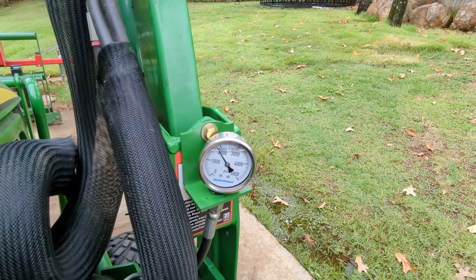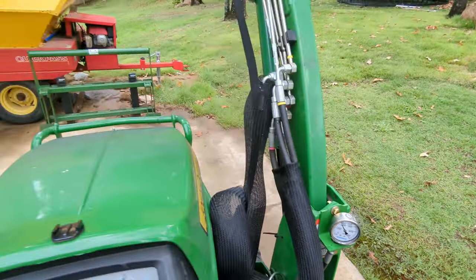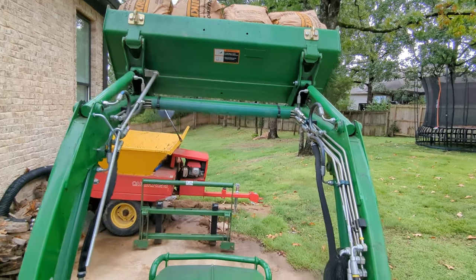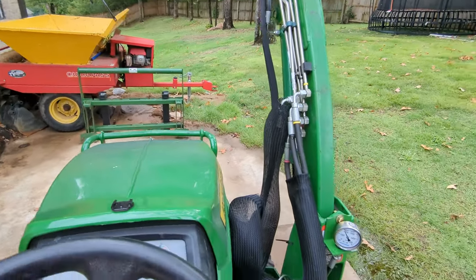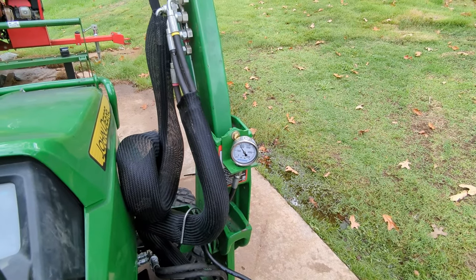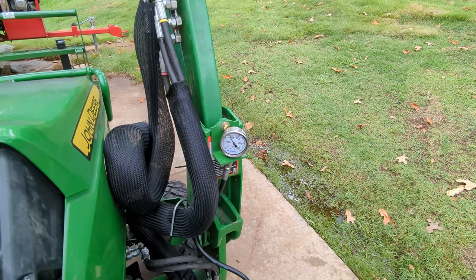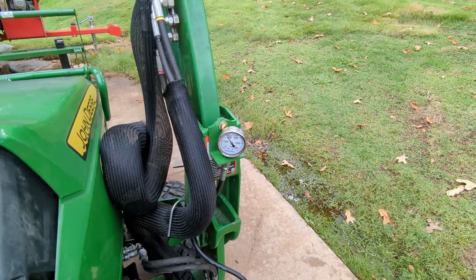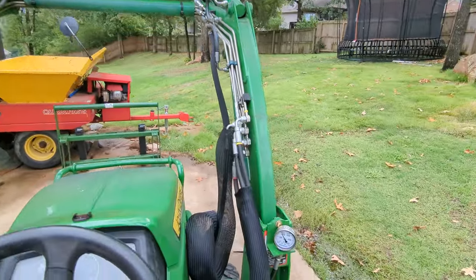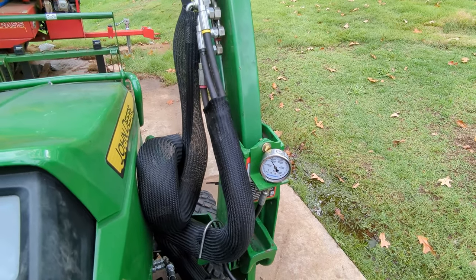At 1900 psi is what it takes for these cylinders to lift this load all the way to the top. That correlates with what we see in the lift test: you can lift 800 to 900 pounds off the ground, but to full height, with stock cylinders you can only lift about 500 pounds. With these larger cylinders you can lift 800 pounds — which isn't more weight than the tractor can lift, but it's more weight than you can lift to full height.